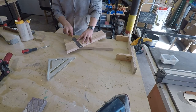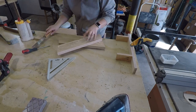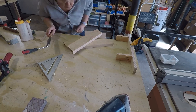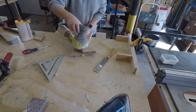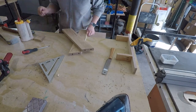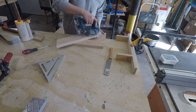I also flipped it over and added two more screws on the other side, which gave a lot of support to those X's so I don't have to worry about them going anywhere. Then I filled all of my screw holes with a dowel, glued that in place, flush cut it with a trim saw, and gave it a nice sanding. I sanded all of my boards before creating the X because that X is a little bit of a pain to sand around, so all it required was a little top sanding. Then my legs were all done and ready to go.